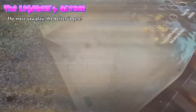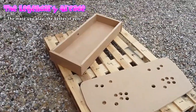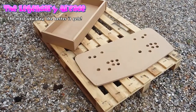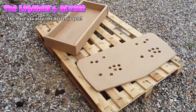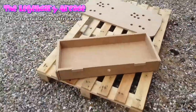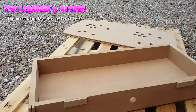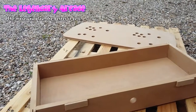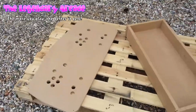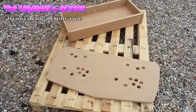The control panel is completely ready for painting — all holes are drilled and it's fully assembled. To prepare a piece like this for painting, you need to make sure it's completely clean with no dust from the tools used when working with wood. First, I use air from a compressor and blow all of the pieces, especially down into all of the slots, to remove any dust. I usually do this outside, and as you can see I've dragged it outside today because it's beautiful weather. After cleaning with the air, you remove the remaining dust using a small piece of cloth with a bit of water, then clean the surface.